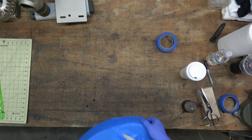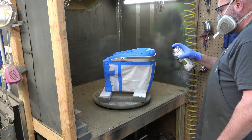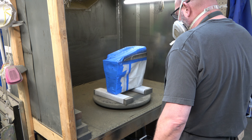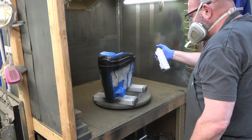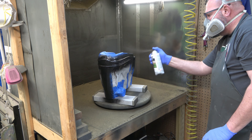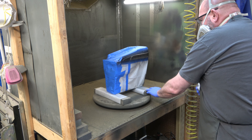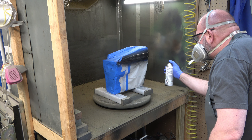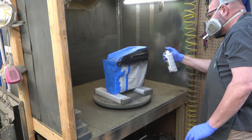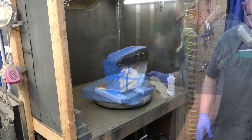The second color that we're going to use is a hammered metallic black by Rust-Oleum as well. Whenever I'm working with spray paints, I try to stick with the same brand for the primer and the paint and any additional colors. And if I was going to clear coat any of this later on, I'd use a Rust-Oleum clear coat as well. I found that if you mix some of these paints, like Rust-Oleum and Krylon or whatever, you can get some pretty bad results — orange peel and that kind of stuff. The only other paint I use with Rust-Oleum on occasion is the Ace Hardware brand paint, but typically I'll stick with the same brand for all the paint.